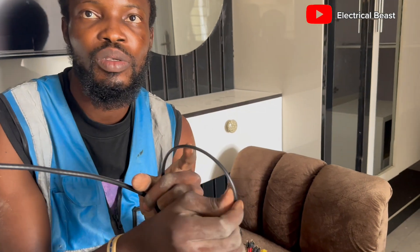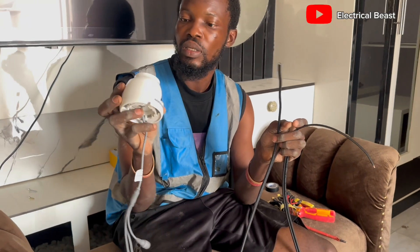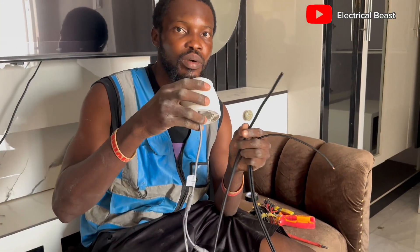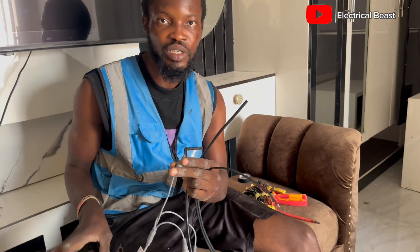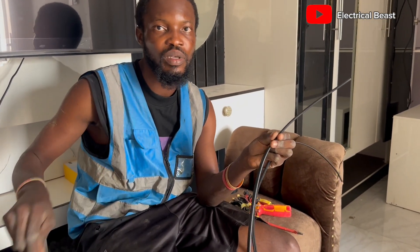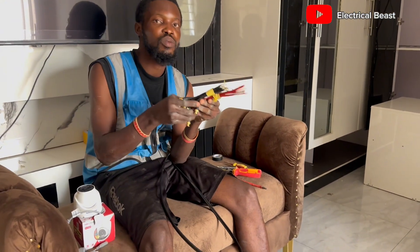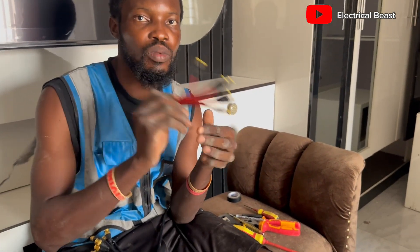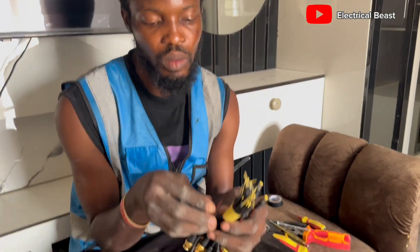Normally the way the camera works is that when you connect this part of the wire to the box, to the power supply, it sends power to the camera. When the camera has power it starts recording. The recorded video is sent back through the other end of the camera to the coaxial cable, then it records on the hard disk in the DVR. Now we are going to learn how to fix the BNC — the video cable for cameras is called BNC. I have a couple to fix but I'll just demonstrate one.